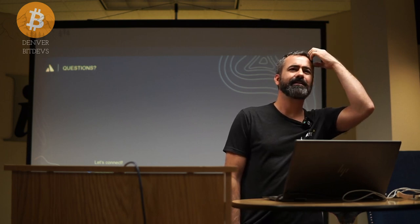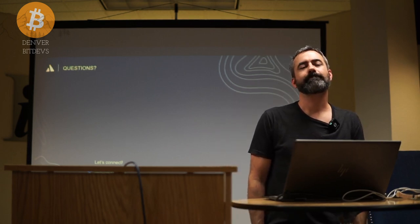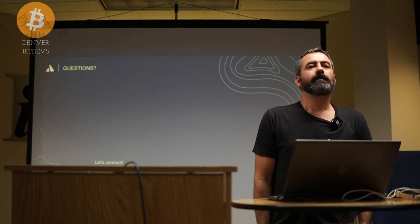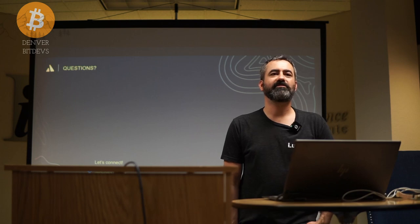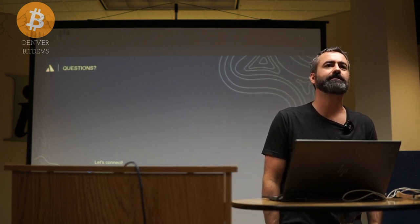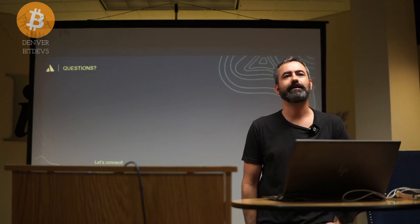Back there, Sam, right? Yeah. Cool. Is that Xilinx board, the control board? You said it's running Linux. Is there an ARM processor on there, or do you simulate a CPU and run the OS on there? Yeah, so on Xilinx, it has a Zynq embedded FPGA. It is an ARM-based processor, and Xilinx supports a few different Linux OSs. It runs something called Petalinux. And that's built into the Xilinx dev tools as well at that low layer.